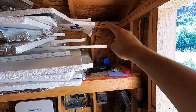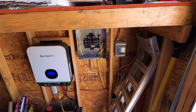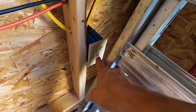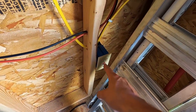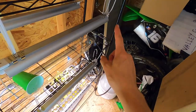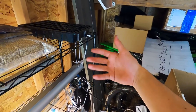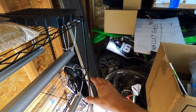Off the AC panel box, here's what we have run. Down here we've got a string of circuits for plugins — the first outlet closest to the panel is a GFI, which should trip before the breaker if anything happens. That circuit goes up and over and drops back down to a plug-in where we're running timers for our grow lights for our plants. We have another one wired up in the back that's going to power a temperature-controlled fan as the summer gets warmer, to help keep it cool in here so the plants don't get too hot.